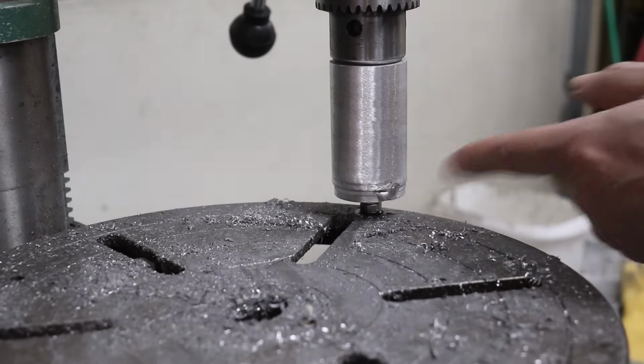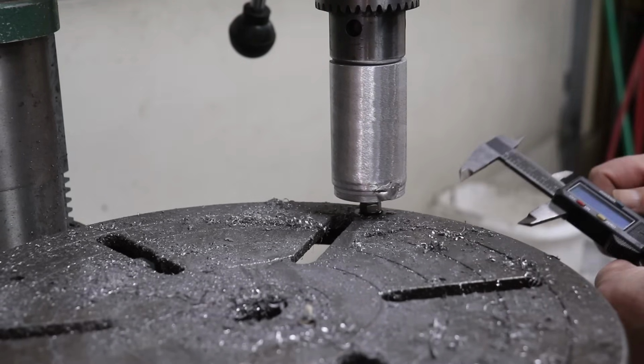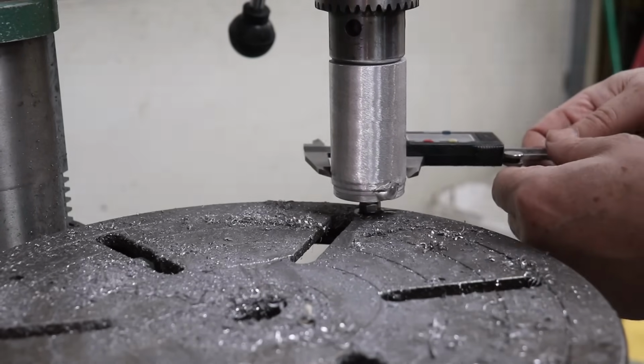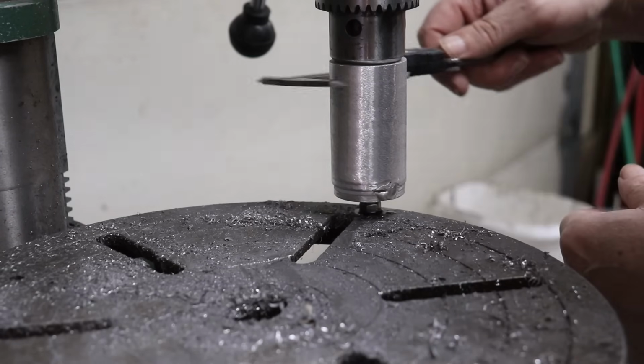So I just welded a plug on the other side of that, stuck a bolt through up into the spindle, or into the chuck, I guess, and tightened it down. And it's just double nutted there. And I'll just use my grinder to turn it down.